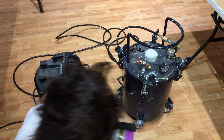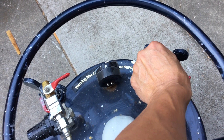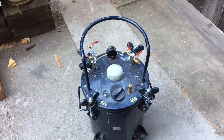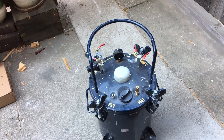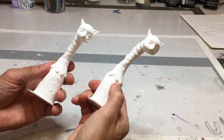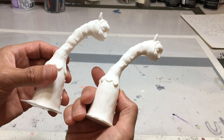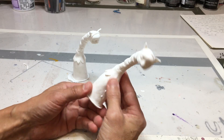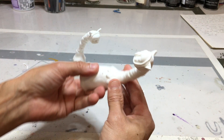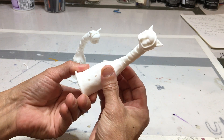Then I'll roll the pot outside and release the air pressure. Remember that any gas and vapor from the resin is inside that pot, so wear your respirator when you do this. When comparing the figure that was pressure cast with the figure that was not pressure cast, they are virtually identical — neither has any air bubbles. But this is a very simple figure to cast — it's almost a straight shot down with the resin. So a figure like this, you probably don't need to pressure cast it.